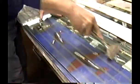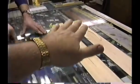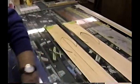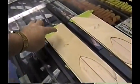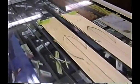Extra chunk of glass, and when we get the epoxy mixed and put on the doublers, we're just going to lay it in between the two pieces of glass under compression. Let's clean all the schmutz off of that. And see, we don't want to get any glue up on the last inch or so, so then we can just, again, pull that nose together. It saves so much carbon.